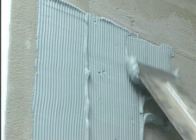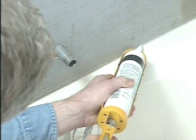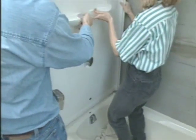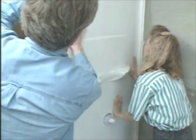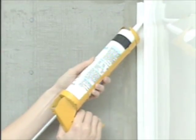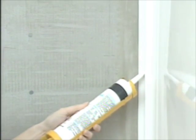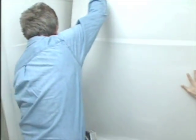Use one of the adhesives recommended by the manufacturer. For this brand, spread the adhesive out with a notched trowel, just like you do with vinyl flooring or ceramic tile. It's also a good idea to put caulk along the edge of the tub before you set the panels in. For this brand, the panels for the plumbing wall and the head wall go in first, then you trim the center panel to fit between them. Some kits have panels that merely overlap at the corners, but this brand has an interlocking corner that should be pretty watertight — nonetheless, put caulk into the channel before installing the back panel.